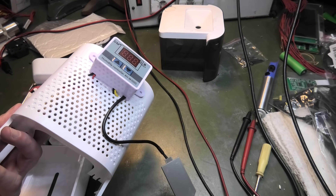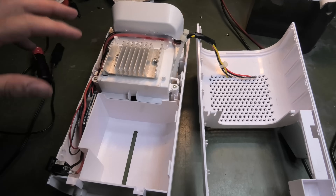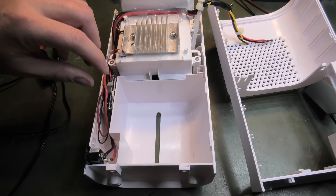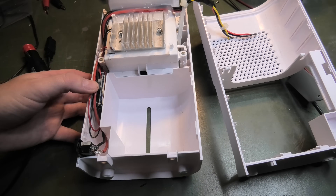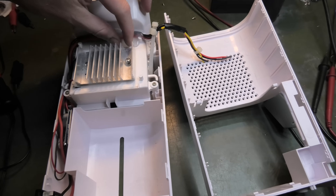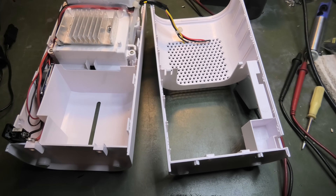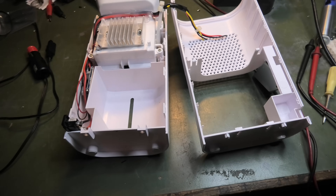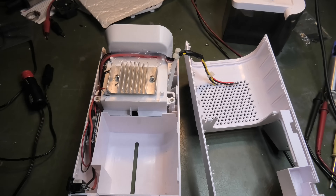The 12 volts goes in here and over here, and here is a humidity sensor that turns the device on and off depending on the humidity — that's the black and yellow wire. They go back over here and power the DC-to-DC converter. I didn't get the one I ordered, but it's getting really humid in the bunker, so I took two of the small ones and combined them. It can supply 9 volts at 4 amps — plenty for the 9V 3A this unit uses.